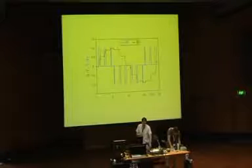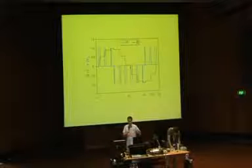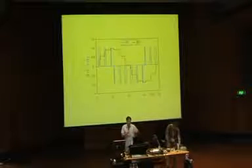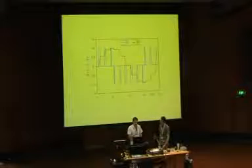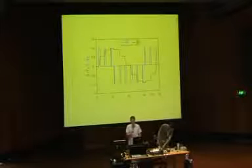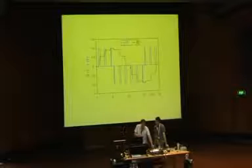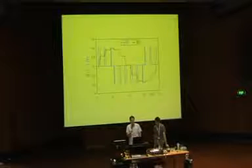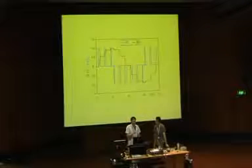Servo motors talk PWM natively. So they will understand that pulse train, and they will move themselves to a position proportional, between the two limits, based on the value that you're sending them. So we've already done a bit of playing around with the servo, so we won't go into that in more detail. But basically, if you want to talk to servos, the Arduino can do it natively. As someone down the front here pointed out earlier, this must be pulling a very small amount of current, and it is. It's a very small servo. If you're dealing with larger servos, you'll probably need electrical buffering in there. But the actual signal that it's going through is the same. It's the exact same principle.